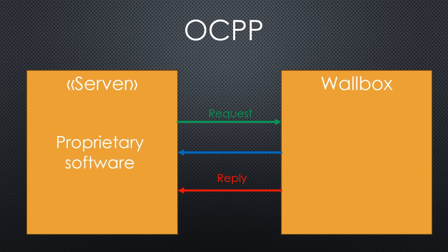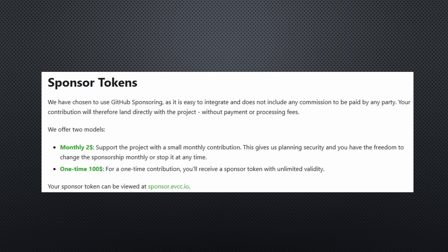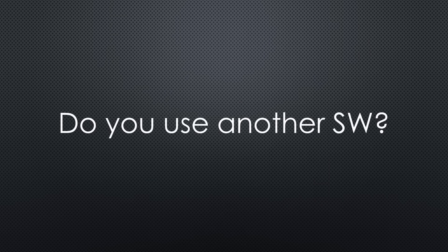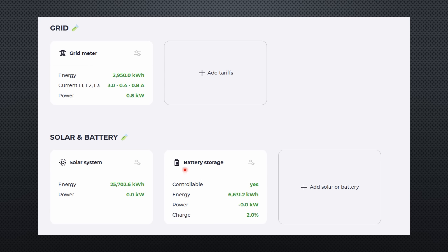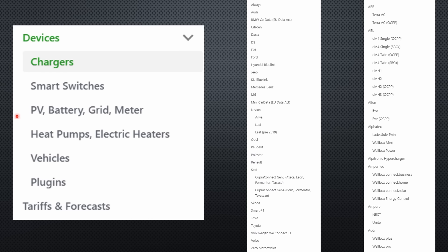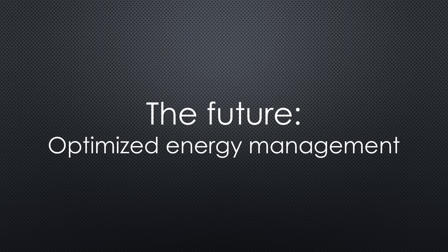You can get proprietary software, but again, not what I want. Home Assistant could do the job, but there is a cleaner way: EVCC. It's open source, though not entirely free — if you use OCPP, you need a sponsor token, which costs $2 per month or $100 for a lifetime. That's fine with me; commercial solutions are more expensive and I prefer supporting young developers for open source software. EVCC can read data from my Huawei inverter, battery and smart meter and adjust charging dynamically. It lets me choose between solar only, fast or mixed modes, supports many solar systems and wallboxes, and even works with solar forecasts and variable tariffs. Some experimental users even use AI to optimize charging based on forecasts, costs, consumption and tariffs.